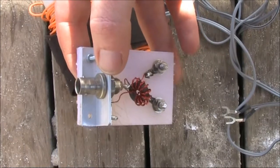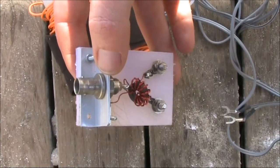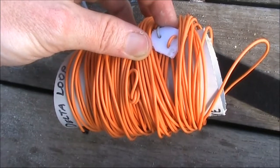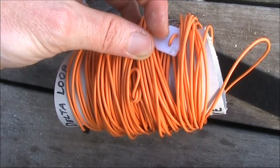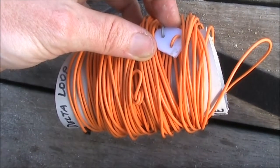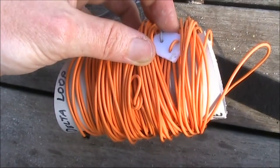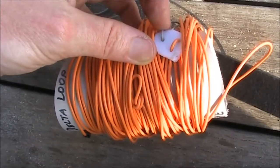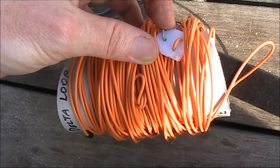I may need an antenna coupler between the transceiver and the balun, especially for bands other than 20 metres. As for the antenna wire itself, I'm still using a small piece of chopping board at the apex of the antenna that's tied to the top of the squid pole. The reason for that is it saves the inconvenience of having to thread the whole length of the wire through the eye at the top of the squid pole.